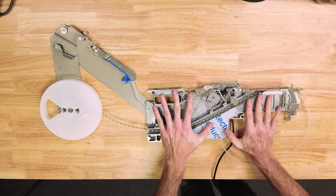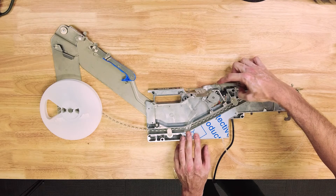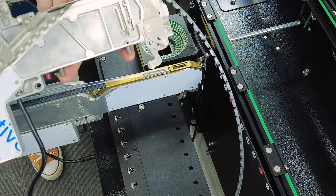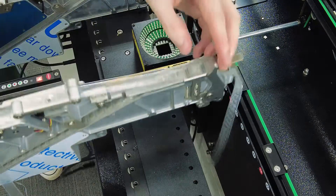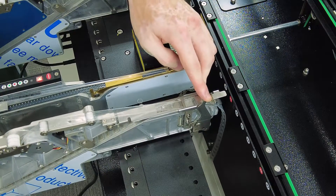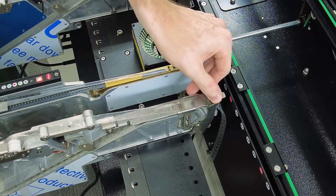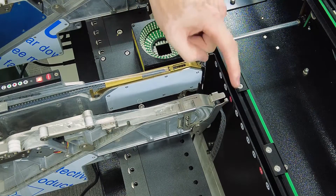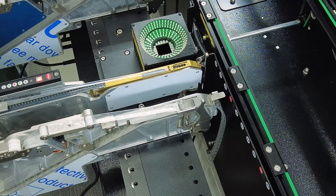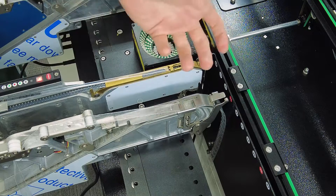You don't really need to pre-tension these ones because when you power the feeder initially, it will tension the film using that Hall Effect sensor. The feeder has two alignment dowels to locate it on the machine. Insert the feeder at your location of choice, make sure it's sitting nice and flat, and then push that lock forward. I like to remember how these work: if I'm pulling it, I'm taking the feeder out of the machine; if I'm pushing it, I'm giving the feeder to the machine.